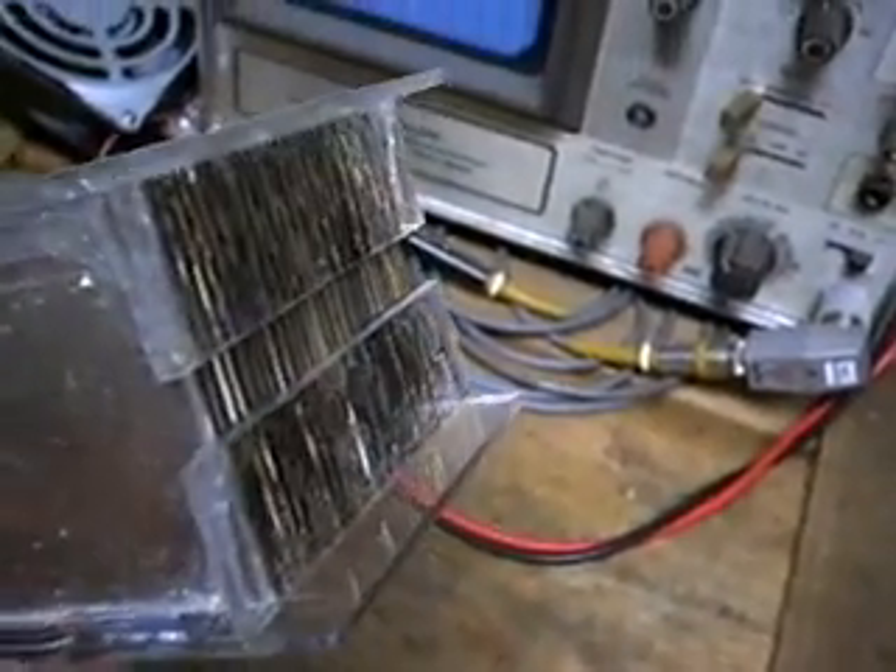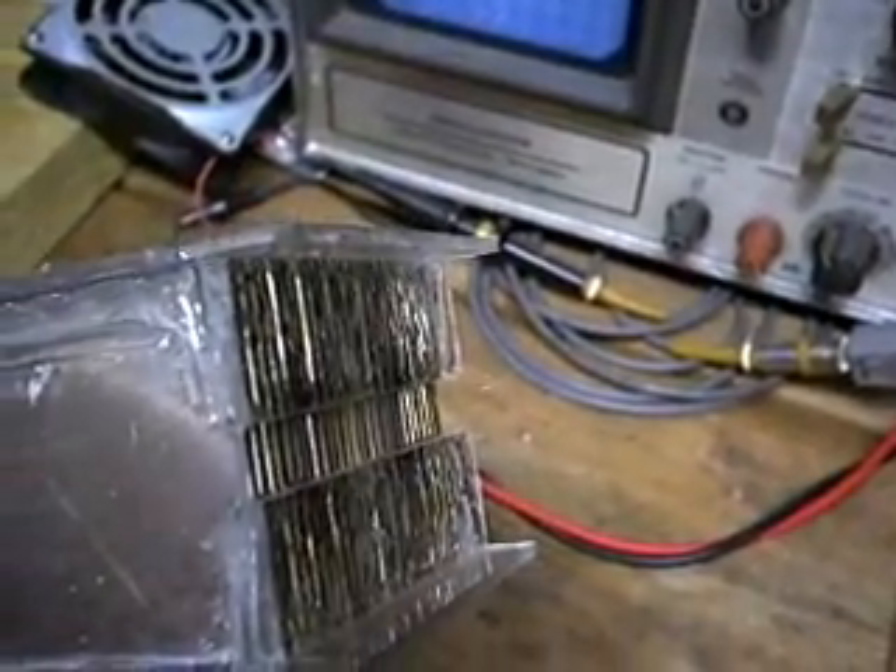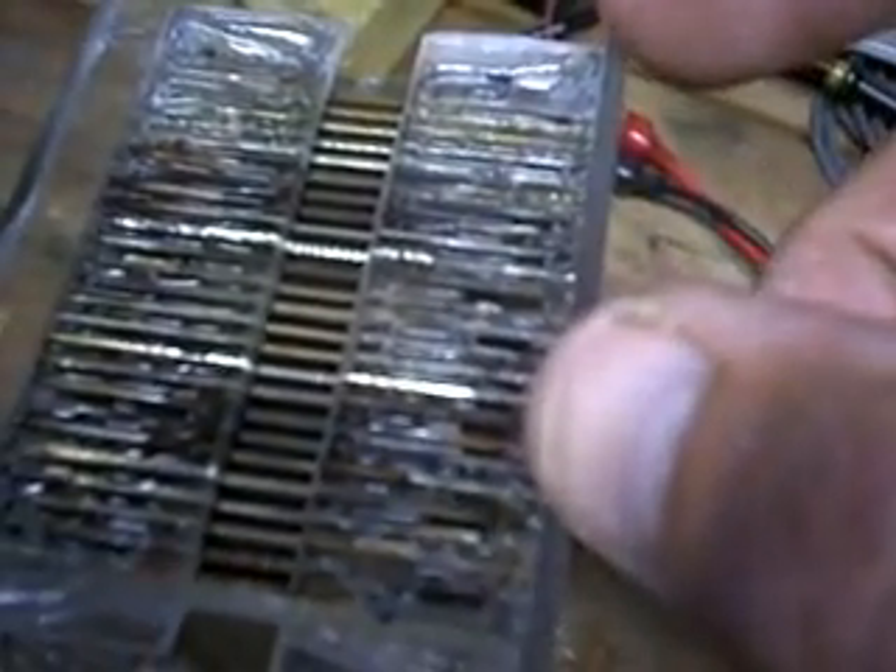You can see the acrylic panels are getting glued together very nicely. I have the bottom of the cell sealed off with plates to just allow a 3/8 inch wide inlet gap inside, which also limits the exposed surface area of the plate edges. I'll be taking a little bit of goop and sealing off the remaining edges just enough to create a thin layer across this remaining gap so that the exposed edges are no longer in solution, at least not directly. Hopefully, the adhesion to the acrylic pieces on either side will be enough to hold it in place once it becomes detached from the plates through the process of electrolysis, and it will just sit there and stay wrapped around the edges of the plates without floating away.